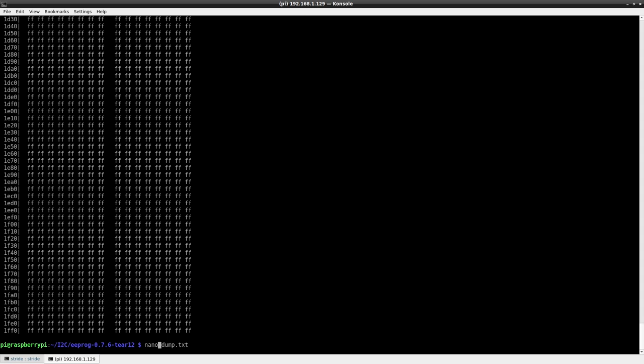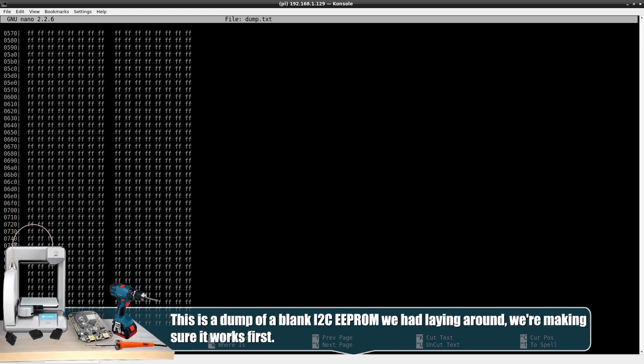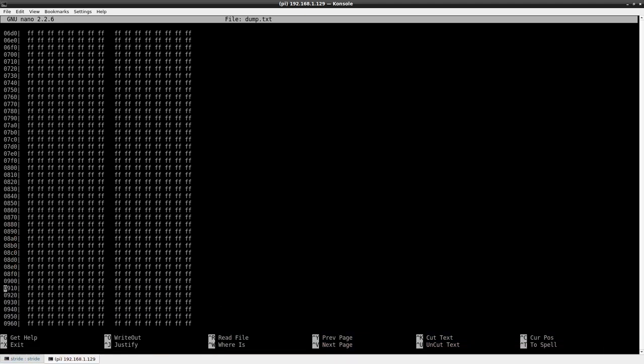Like the address? Yeah, I want to see it now. Oh yeah, okay, so the same thing. Mm-hmm. So it's like an ASCII hex dump. So you don't want this first? No, that's fine. I'm just saying we couldn't just cold turkey take this and write it back because it's got all these extraneous characters in it. Because that's not 255, that's the ASCII letters FF.